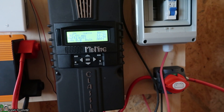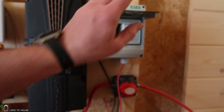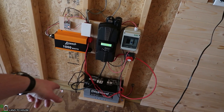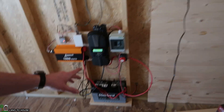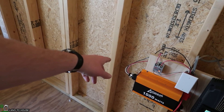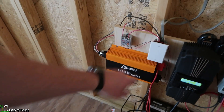The sun should be out for the next several hours. It's two o'clock, so about three more hours of sun, and that will hopefully charge this back up. I'm glad that we at least figured out what was going on here — that battery should charge up and be back to normal. With this issue, I think what I'm going to do is continue to use the off-grid solar but add a second battery over here, which will double my time. Also, if I'm going to be doing a pretty intense project that needs a lot of power or light for a long time, I'll add a little receptacle or a box that will allow me to run an extension cord up to the house.